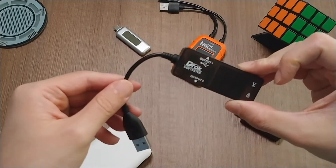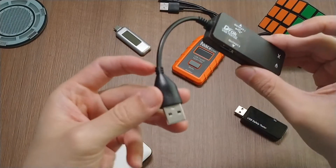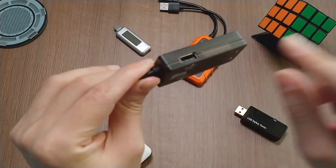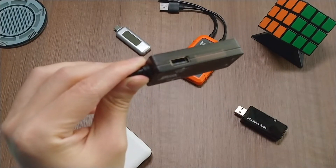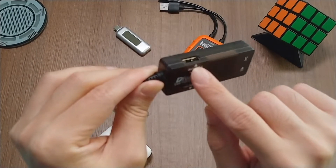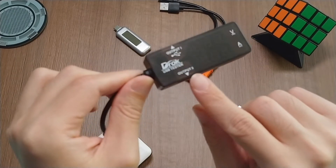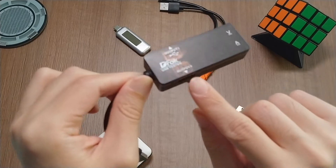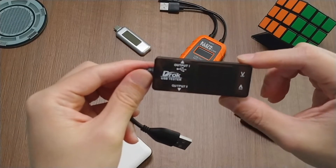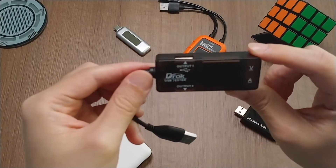This one is probably one of the oldest style. It has a USB pigtail cable for plugging in to your power. This one is a USB port that actually connects to a QC-capable charging device, or any charging device that needs the D-plus and D-minus connection. This port is only for the USB power connection, so there won't be any connection between the D-plus and D-minus.